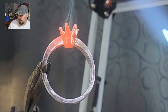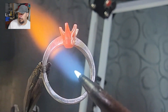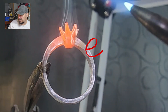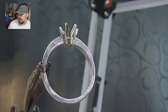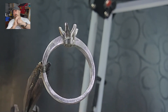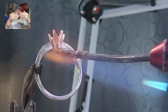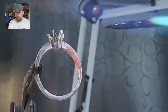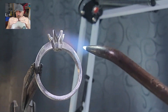Once you're happy with the way it sits, you can apply some solder — a nice platinum solder — and make sure the joint is nice and strong. I always do one side first, make sure that everything is still lined up, and before I proceed to solder the other side I check again. I was quite happy with the way it's set. Usually the heat causes the metal to move ever so slightly, so I just like to make sure it's all back in proportion.